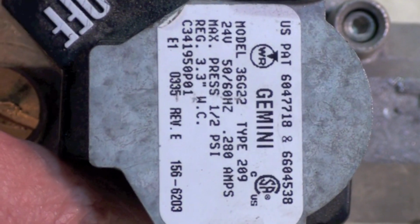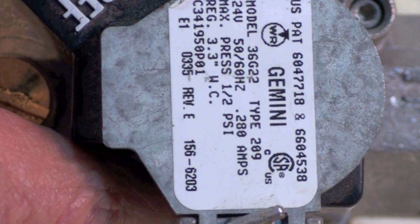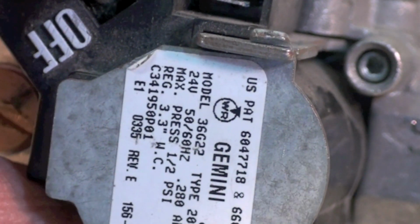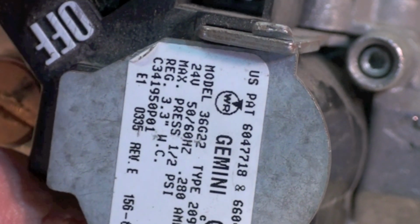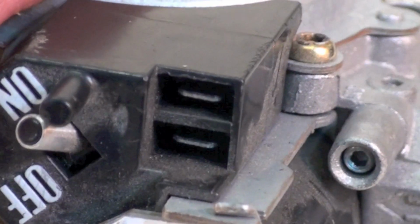and now we'll read inlet pressure. Here again, just open it up a turn or two, and you will get your reading for your pressure, and it just leaks a little bit of it out. When you're done, of course, close it up and leak check it as you would anything that you've opened. But that's the way to do these things.